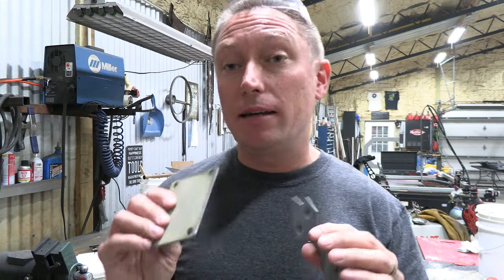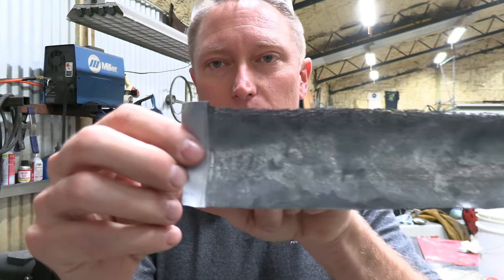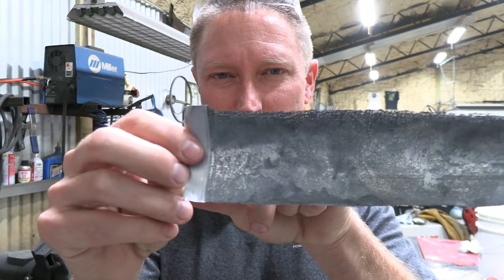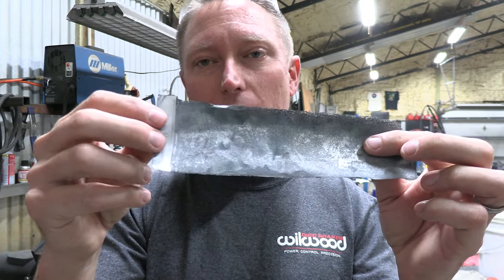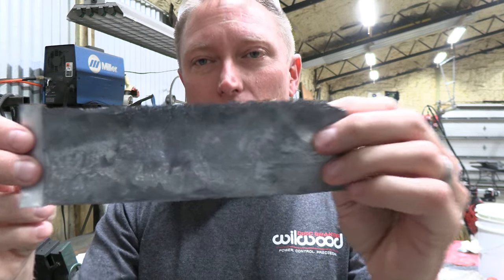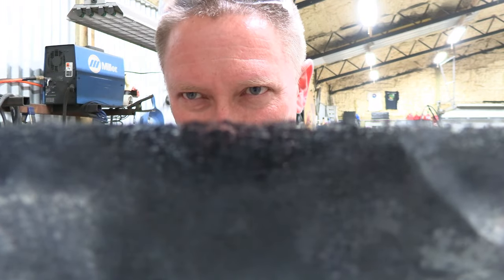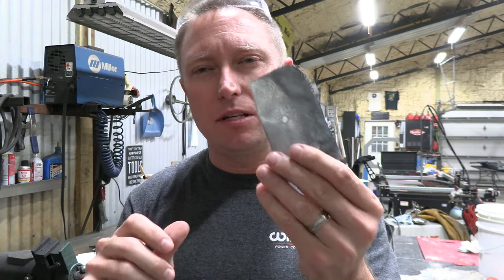There's something I want to show you — this is one of my pieces of sacrificial anode, and if you have a look at the edges you can see how it's been eaten into the side. The end that was submerged in the water feels thinner than the end that was out of the water, so you can actually see the zinc just disappearing as you're using it — it's interesting how that happens.